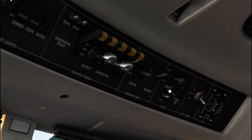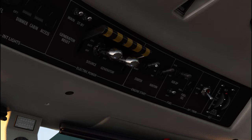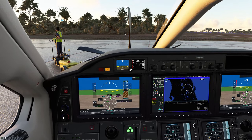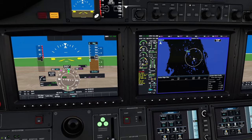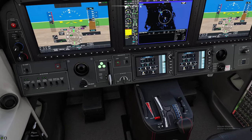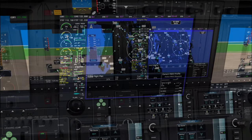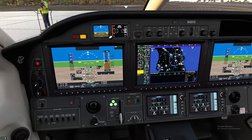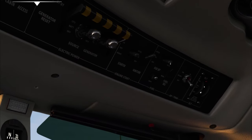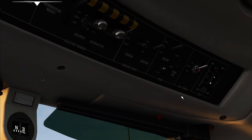Next, turn the fuel pump booster to the on position and make sure the fuel selector is in manual mode. Then come over to the starter and slam it up to the start position for two seconds — the propeller will start turning. Once we reach around 20% NG, we add fuel. We monitor NG until it gets to about 50%, then throw it into high idle, then taxi mode to let the engine equalize. Come back up top and put the booster pump in auto, tick the autopilot trim on, and set the fuel selector to auto mode.